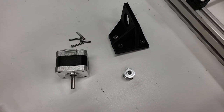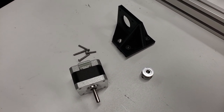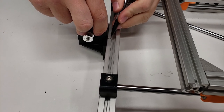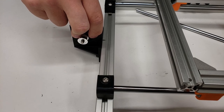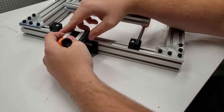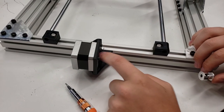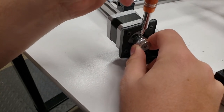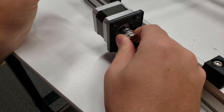Our next job is to install the stepper motor. We're going to need a few different screws, the stepper, and the timing gear from the belt — all linked in the description. You're going to want to mark the center of the extrusion where you'll install the stepper motor bracket, and use only the two bottom screws of the bracket when you mount it to the extrusion. Once that's complete, install all four screws of the stepper motor to connect it to the bracket. On the shaft of the stepper motor you'll find a flat spot — match that up to one of the grub screws on the gear and screw that in. The flat spot helps keep the gear from turning while in use. Do the same for the other grub screw, tighten it up, and your stepper motor is all installed.